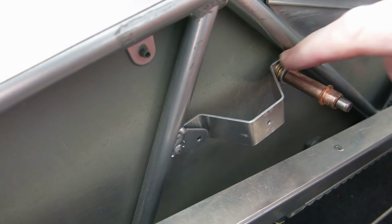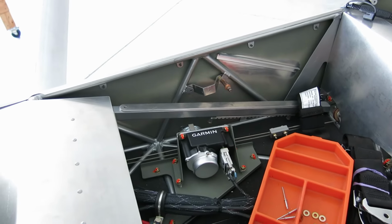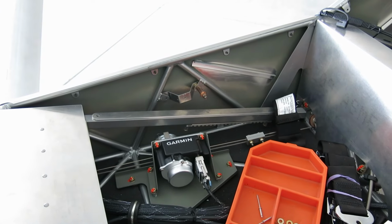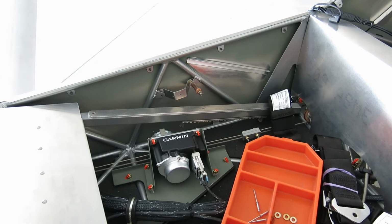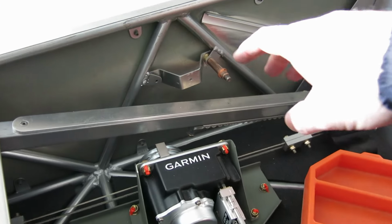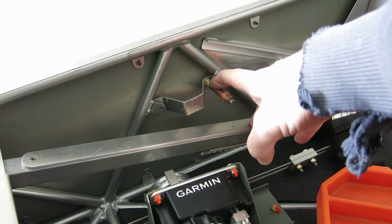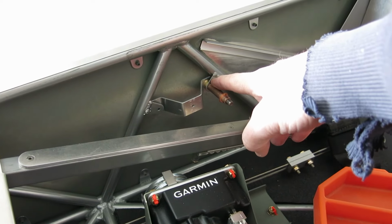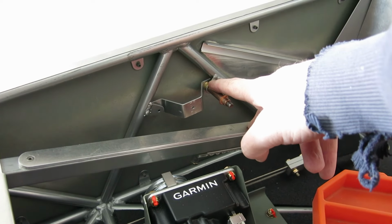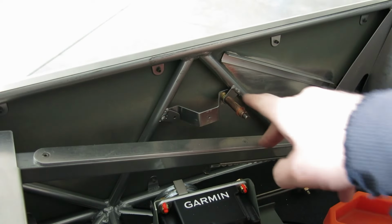This took three, I'm just using the thick washers. Just using those in there. Now I know this is a 30 rivet that goes in here, and those washers are for an AN3, so the hole is bigger than a 30. So it's taking three of those on this side, on each of those tabs.